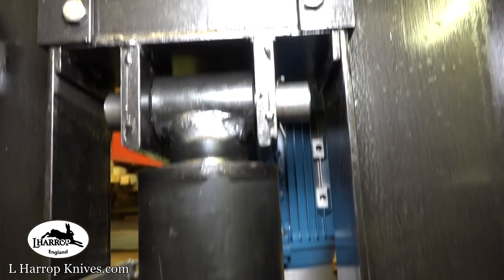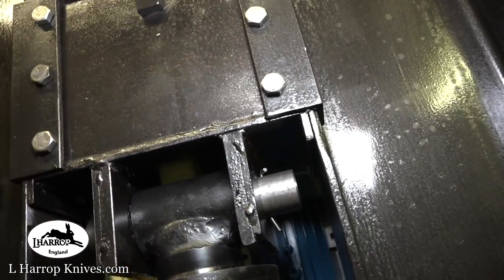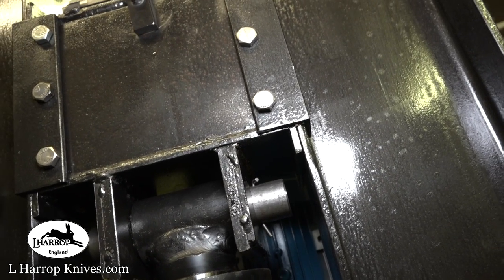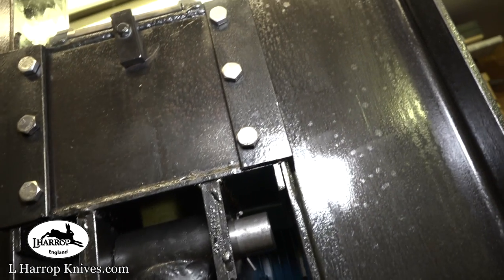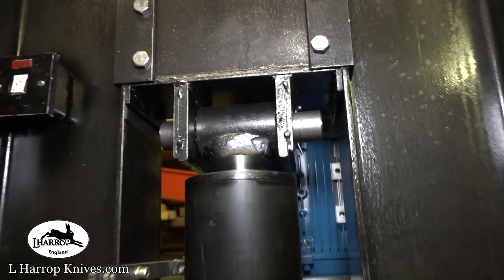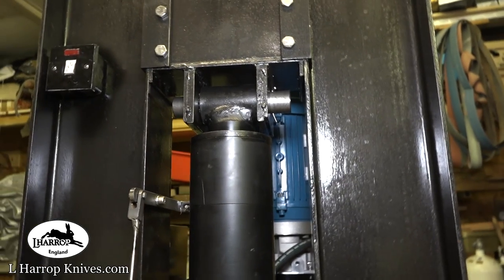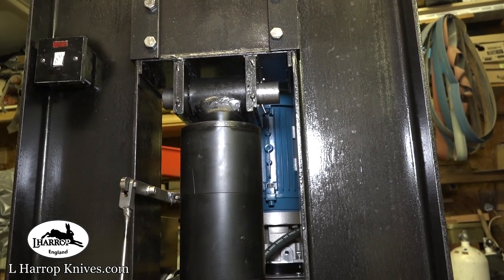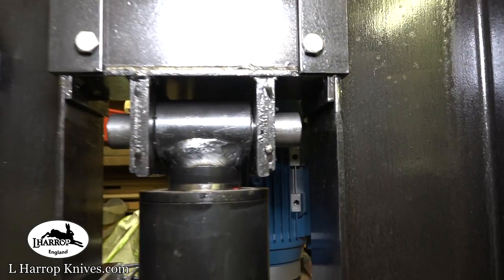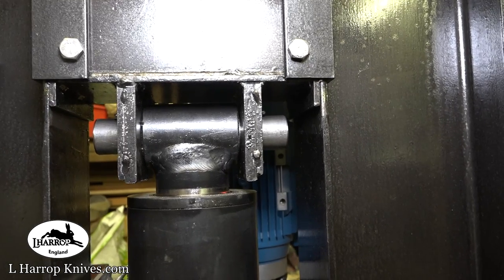And then the next section is really heavy duty, 1/2 inch and 1/4 plate, so it's 3/4 of an inch of steel. I had a nightmare drilling these 40 millimeter holes for that clevis pin in there. I ended up destroying 3 hole saws, and the last one, a Bosch hole saw, just did it with ease, no problem whatsoever.